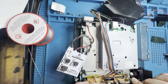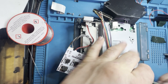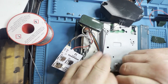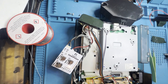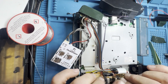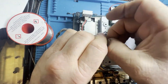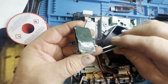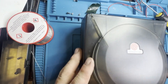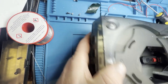Popping the board back in now — this Dreamcast has had many mods. There is an ODE replacement, but I didn't ultimately go with it because I had a few boot issues. I didn't realise at the time that this Dreamcast had a modified BIOS I'd done which allowed it to boot straight into Dreamshell, and this conflicted with that ODE. So I decided to go with an IDE to compact flash solution instead. Everything's wired in and I've double-sided taped the ESP32 down onto the circuit board.